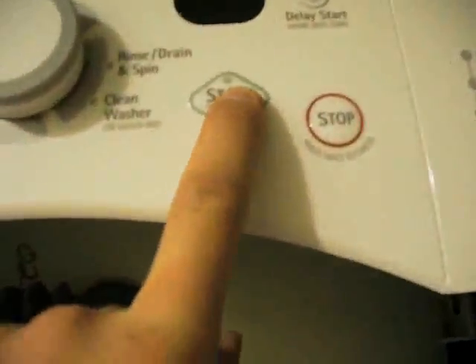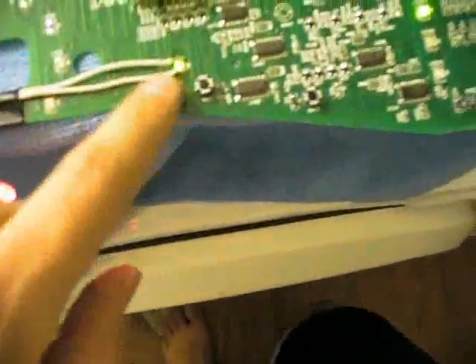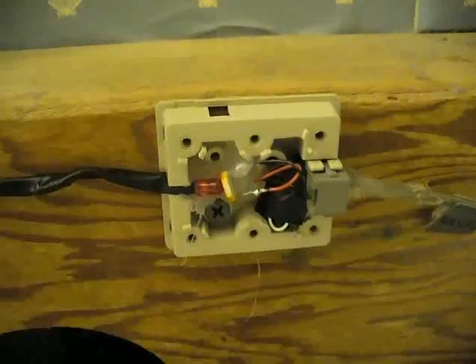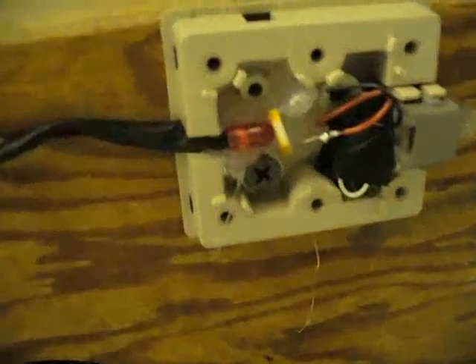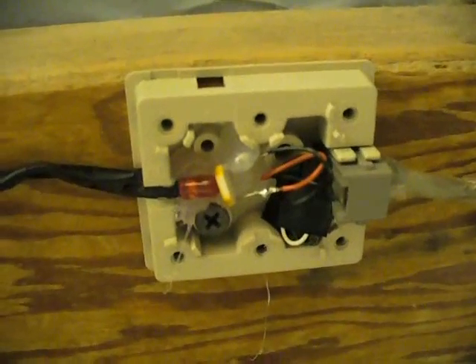Here I've wired into the front display panel to the start LED — same as the power one. If we turn the washer on, it lights up, and so does my LED that I soldered in parallel. Here's the washer box — all we have is the LED. We don't need a resistor because we're just running it in parallel off the status light on the washer, and the photoresistor is connected to the RJ11 port which goes to the Arduino.